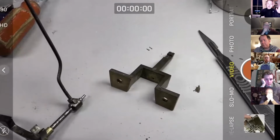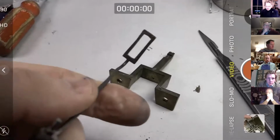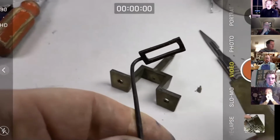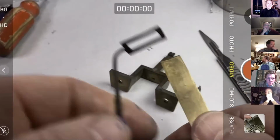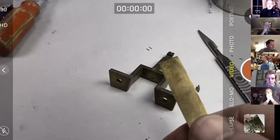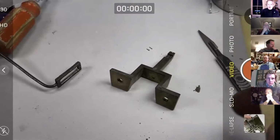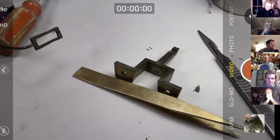First thing, check the suspension spring and that everything can hang vertically. Second thing is to make sure that the backcock slot and the crutch are aligned. And the third thing is, when you put the top block of your pendulum in here, make sure there's a bit of oil on both sides so that it makes a kind of viscous coupling, if you like, using the term slightly loosely.